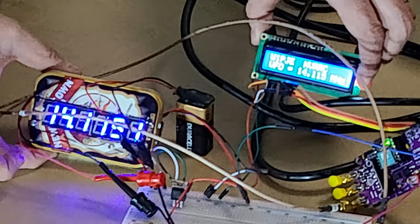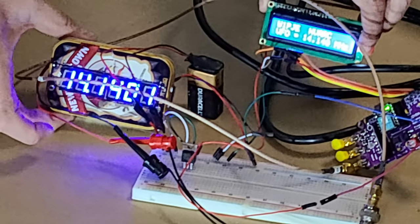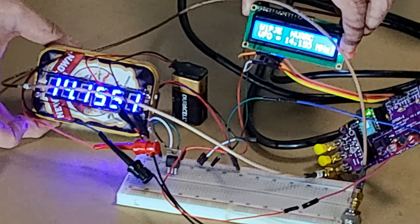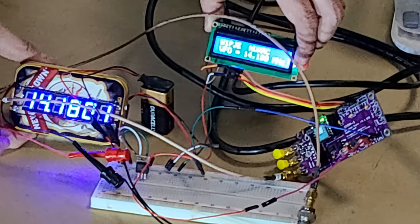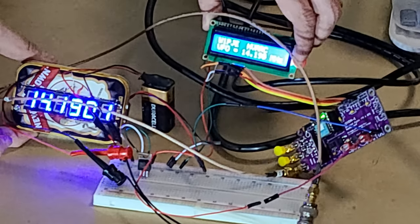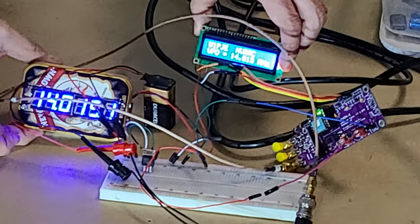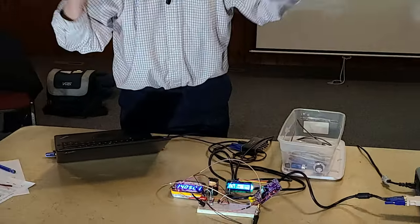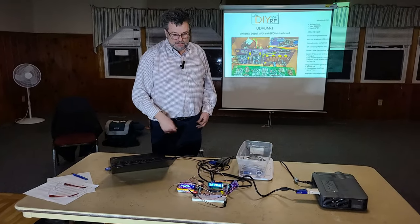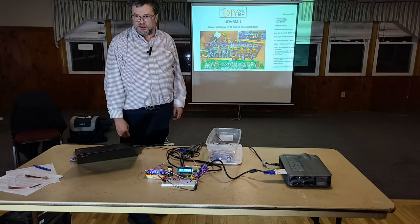When it gets to 14.200 MHz it will reverse and go back to the beginning. There's the little LCD saying hello to the club and telling you what frequency it's set to, being independently verified by the frequency counter. I think there's maybe $35 in all of this. I've got one output, and if I hooked up another cable I could have another output at exactly 90 degrees phase shift from this. Let's watch it roll over: 180, 185, 190, 195, 200 - back to zero.